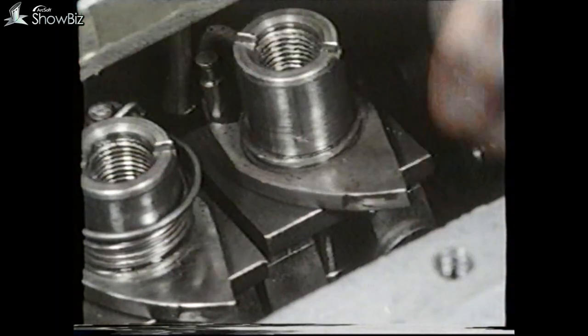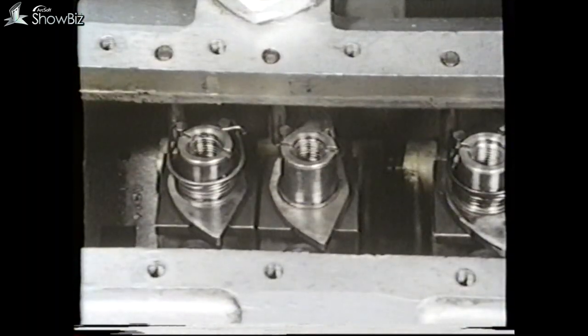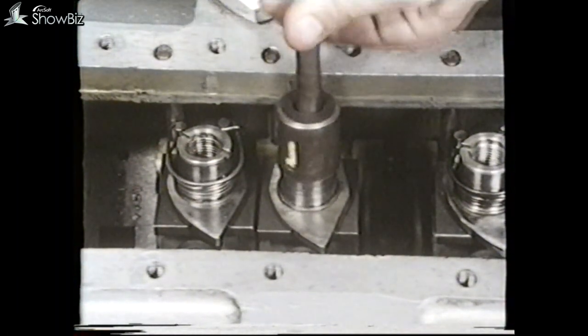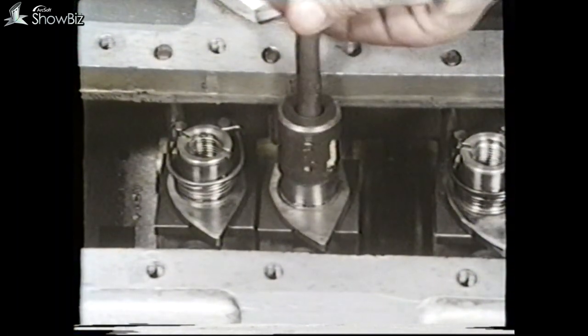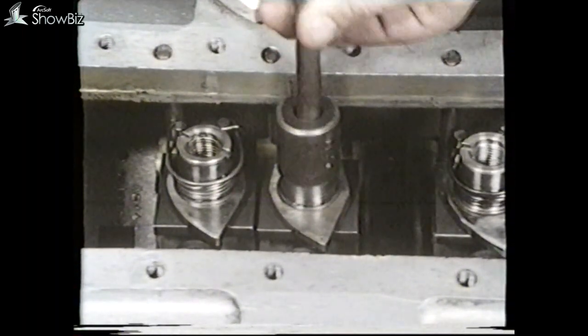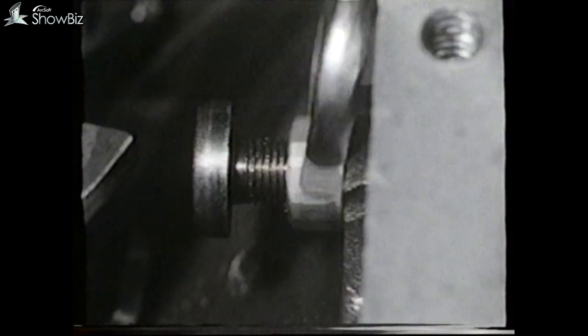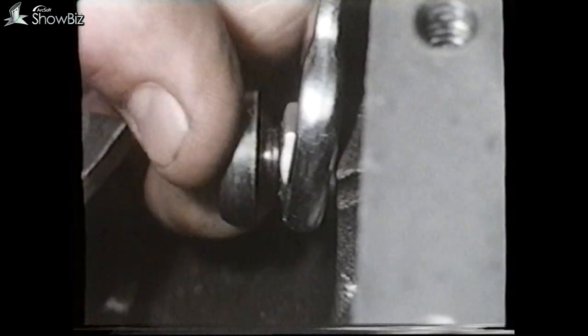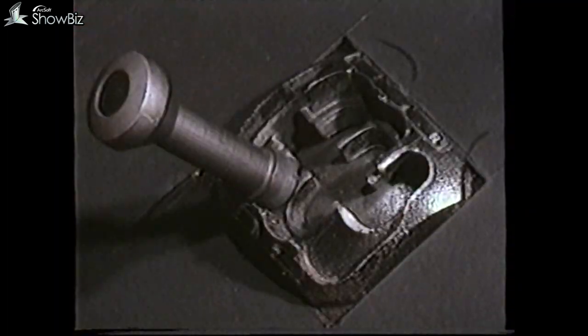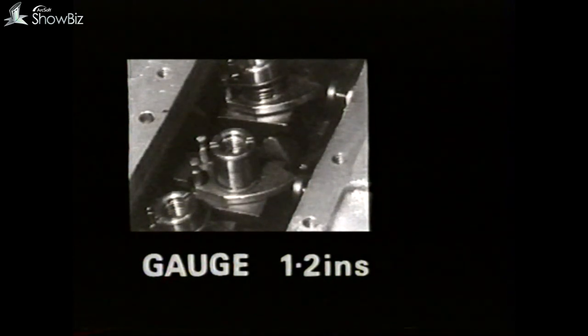Now with the mechanism in position, and using the special spanner, tighten the brake band so that it becomes centralized on the brake drum. When the band is fully down, take the adjuster nut back three half turns. This will provide an approximate position for the start of the band adjustment setting sequence. Before proceeding, release the lock nut on the striker screw and screw it in. Then with the engine running, apply third gear and check the distance between the brake band and the adjuster table.